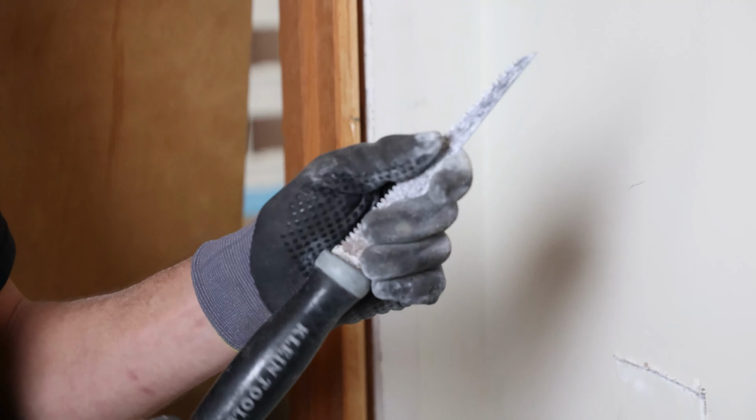So one thing I need to do is the elevation has got to be right. So I've got a 1/2 inch reveal. Again, that's my 1/2 inch drywall. Can't forget that. I've seen so many, like number one apprentice mistake is the nail on the box right there.